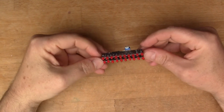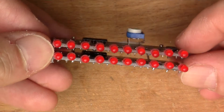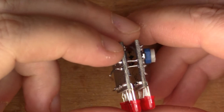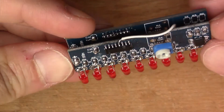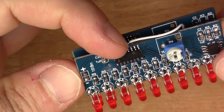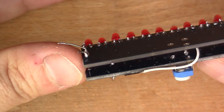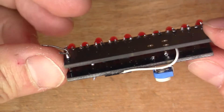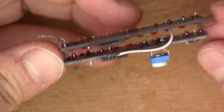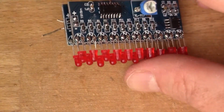This is the starting point — I've now got two layers of LEDs, two boards sandwiched together. They're sharing the same power wires at this end. You can see in here this bodge wire — this is the carry-out from the top board going down to the clock input on the second board. That means the bottom board is getting a divide-by-10 pulse: the clock from the 555 divided by 10 goes to the second board. Let's power that up.